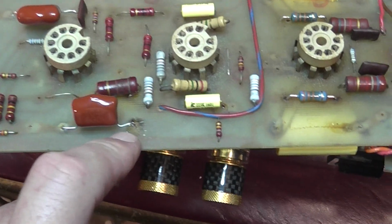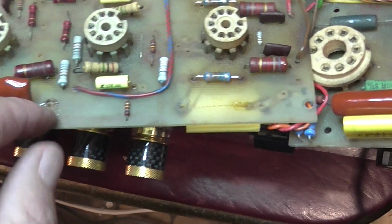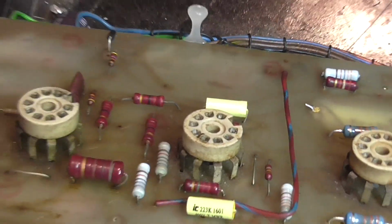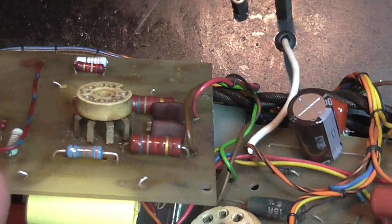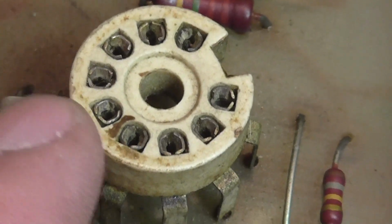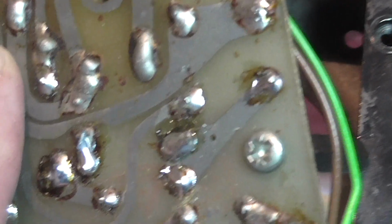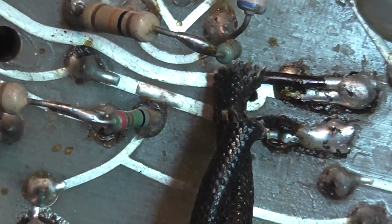Also, I can see these amplifiers went through many repair stages at different times, and clearly I guess all these types of resistors are the original ones. I've also been measuring many of the resistance values, and they don't seem to be okay, so I don't know. Then we can see there's a lot of dirt from the decades here. Nobody in all this time decided to clean all this. I don't know why, because they did all this work, but they haven't cleaned it, and they also didn't clean the flux residue. They're really a mess. These boards are all a mess, and we have these resistors flying around.